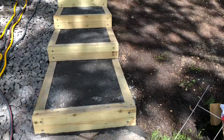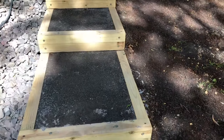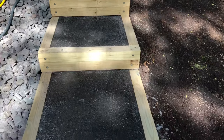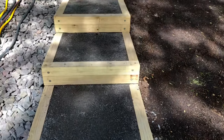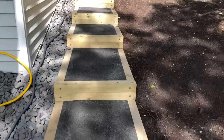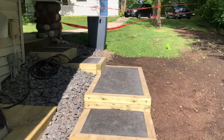Here's the somewhat finished version of these stairs — went ahead and got them all filled up. I filled them with black sand; you can do gravel or pea rock, whatever you feel is suitable. The black sand is easy on bare feet but it ends up being kind of messy — some spills out on the sides. I may skim that top inch or two off and put some gravel in there to hold it in better and give it a cleaner look. That's the project — I hope it helps if you're doing something similar. If you have any questions, go ahead and comment below. Thanks for watching.